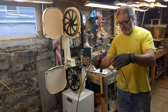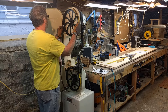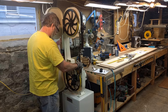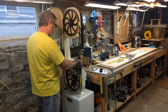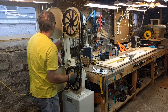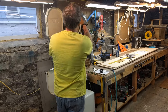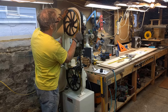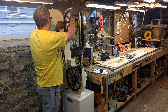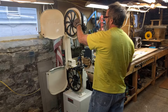I'm going to go ahead and take the blade — I believe this is a three-quarter inch. I'd like to say I could do this as fast as I've seen it online, but it just takes practice. Have patience, don't rush it. The best place for the kerf of the blade is in the middle of the wheel. The kerf is where your teeth go — you want that positioned to the back, in the middle of the wheel.